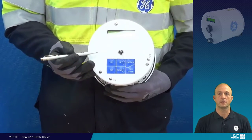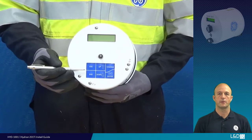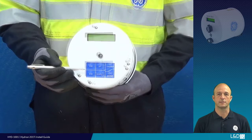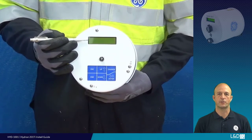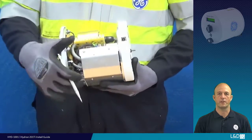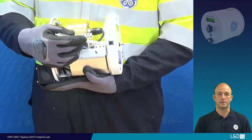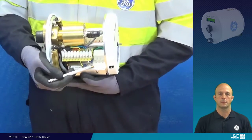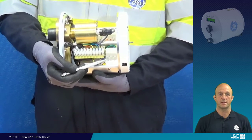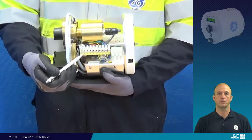Now let's remove the cover and look at the internal features and parts. First we have the central processing unit, CPU — it has an internal battery to maintain the system clock. There is a press button HMI to change settings, system configuration and view trending data. An LCD screen to display gas levels, trending and system information. On the left hand side we have the local USB port to connect with either the operating software Hydran Host or GE's Perception diagnostic software. The mains wiring connections are behind the CPU with a cover to protect and limit inadvertent contact.